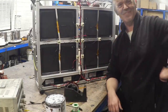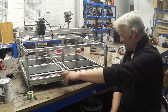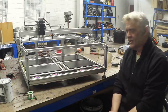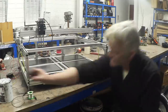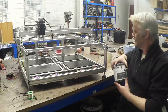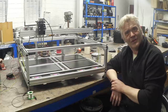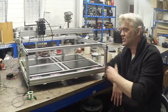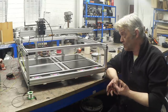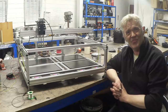There's my silo printer with all the beds done — apart from this one which has a fault, so I'm going to have to replace it. It's heating up really nicely. I made those heating plates by painting conductive ink directly onto Teflon-coated cooking tins, making a super heater. I thought I'd share that: one, to show where we are with the silo machine, and two, to go through how to make a heat plate that could be used in the silo machine but equally in 3D printing. I hope that was of interest — thank you very much for watching.